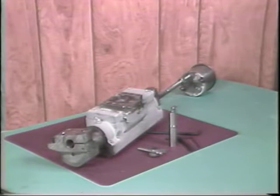This swing-type recessing attachment works similarly, except that it also offers the possibility of being activated by a cross slide. The swing-type attachment can be activated two ways, by a draw rod or a cross slide. When using the draw rod, the attachment moves forward to the stopping point set on the draw rod.